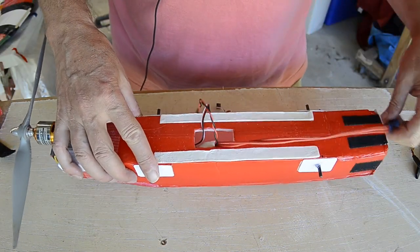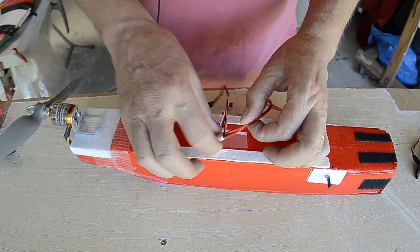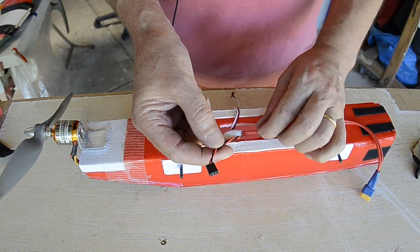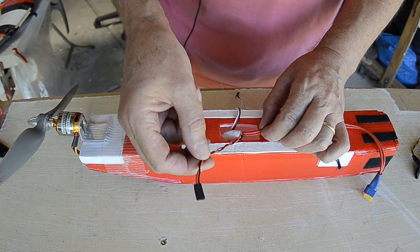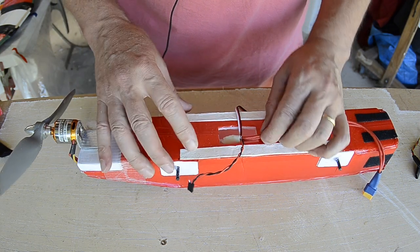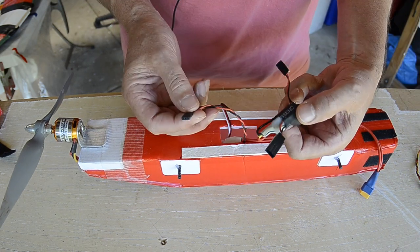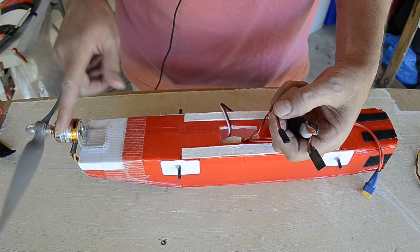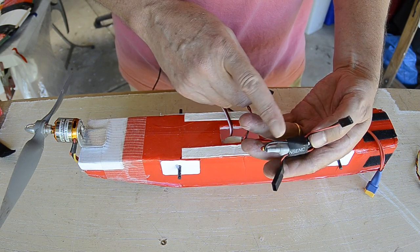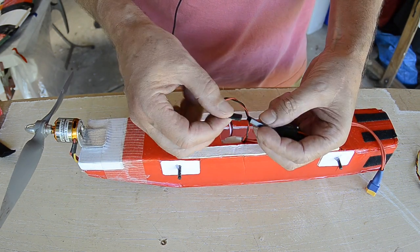This is the power setup. We have the motor and ESC — that's just the battery cable going to the ESC. I've spliced in another little power cable to power the camera, video transmitter and receiver. Into this power cable I plug a homemade LC filter to filter out the noise from the motor and ESC which would otherwise show up in the video. It's just a coil and a capacitor soldered together — very easy to make, just look it up online.